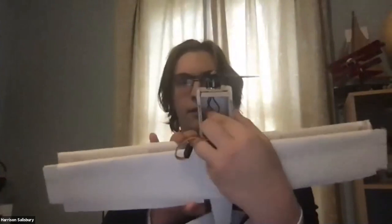Now, moving to my smaller design, with a smaller plane, I didn't have to worry about strong torque forces as much because there's less leverage to actually rip something off. As you see, it did take a bit of a hit here, and it's completely fine, except for the engine plate, which has repeatedly cracked. And if I were to rebuild this, I would add more diagonal struts to the balsa wood to reinforce it even more, hopefully finally.